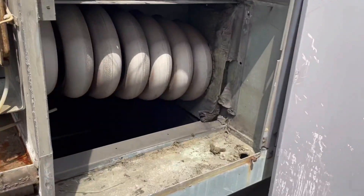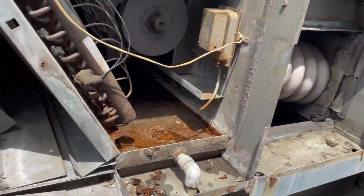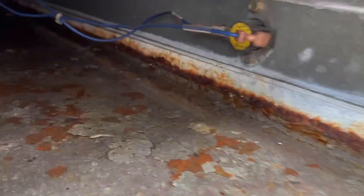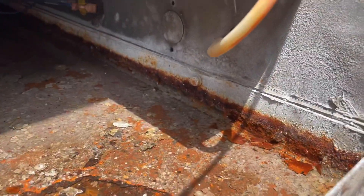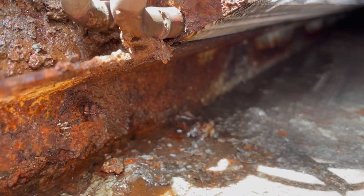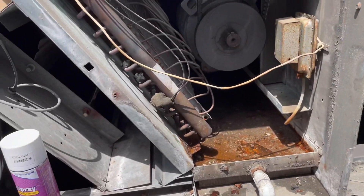That's why I was taking a look at the heat exchanger, just seeing if anything else was going on other than this. In order to change this drain pan — and they do make it — you'd have to take out all these screws going down here all the way back in there. How are you going to do that? Besides maybe taking the roof off, leaning down inverted, and getting in there with your drill somehow between the blowers. And then you've got them on the other side too. So that's not really going to be able to be done efficiently.